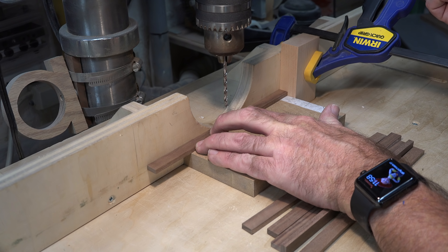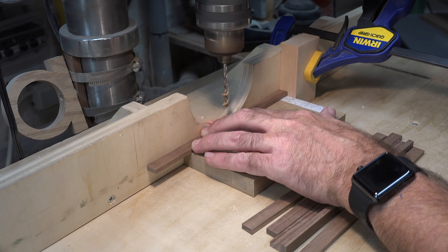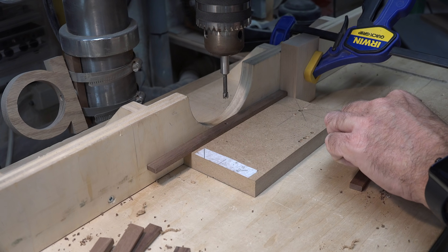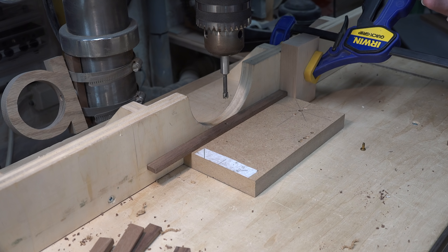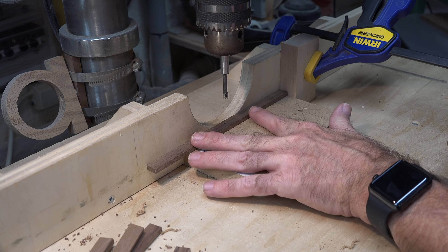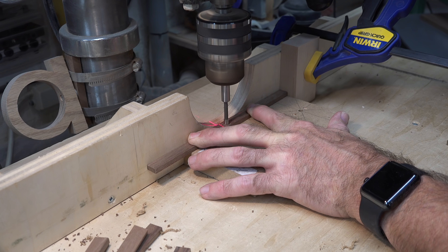Just remember it also duplicates your mistakes. We now need to drill a flat-bottomed hole or countersink for the head of each one of our rivets. While we have our stops and our fence already set up, now is the time to do it for these center holes. I've got a quarter-inch Forstner bit - same diameter as the head of our rivet - and I've got the depth stop set so that we're just going to place a little bit of a countersink; it isn't much.